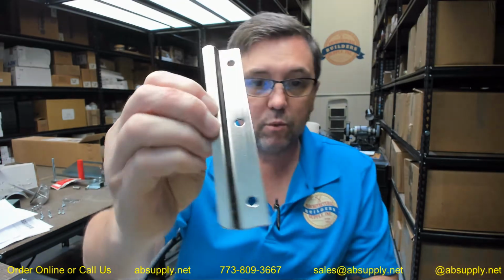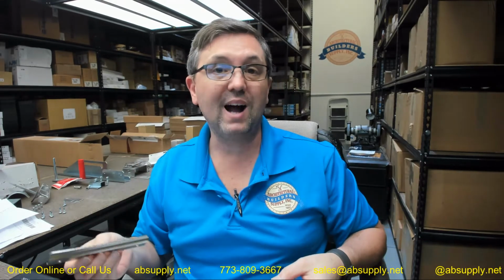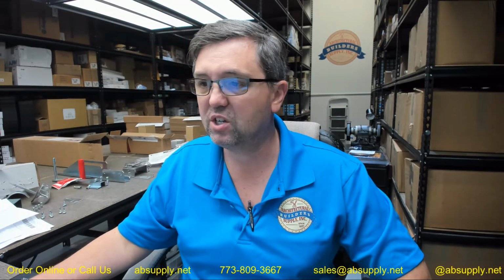Your other ones are going to be your CP, and here's what it looks like out of the package. It will be somewhat reflective. This is chrome, and the BP will be the same sort of reflectivity, but in a brass tone. And the DU will be a dark bronze color, compatible with oil rubbed bronze generally. So the in-swing latch protector, and there is a link below this video to some documents that we'll get into. But an in-swing latch protector like this is specifically intended to guard against manipulation of the latch bolt on an in-swinging door.